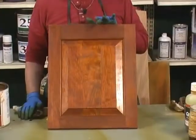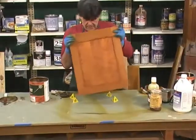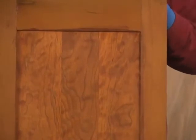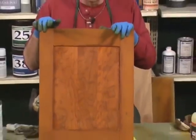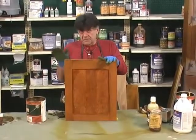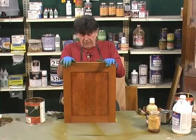You remember how nasty that looked? And then you remember where, like I said, we bleached the center. Well, just for kicks and giggles, I did the back. Remember the really dark board that was in the center? Now it's dramatically reduced, but it's there. So this would be a case for the 2-part bleach, just as we did on the front. When you've got that dramatic a difference, that's hard to deal with, so that's a point where you may consider the bleach.